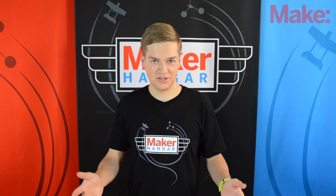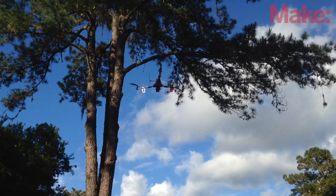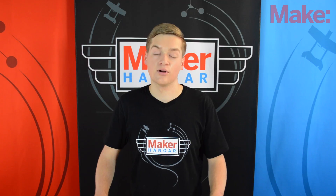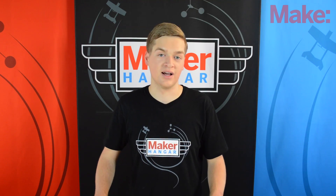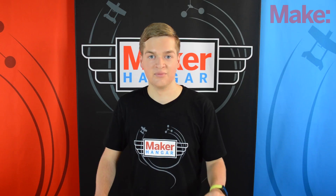This board has some additional sensors like a barometer, compass, and GPS, so it knows the location and orientation of your multi-copter. With this information there's a whole host of flight modes for different situations, like altitude hold, loiter, return to launch, and even waypoint navigation for pre-programmed missions. With the APM, your multi-copter will pretty much fly itself, making it very attractive for people who have never flown before and have the money to spend.